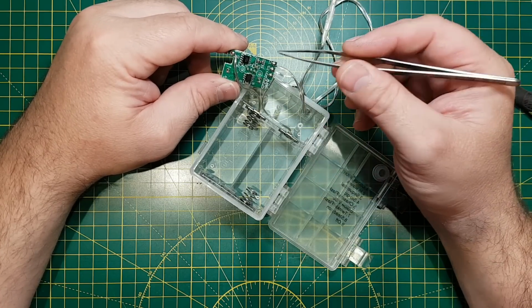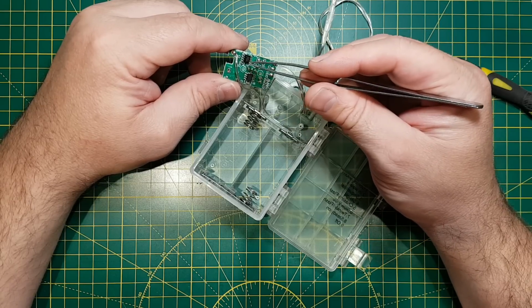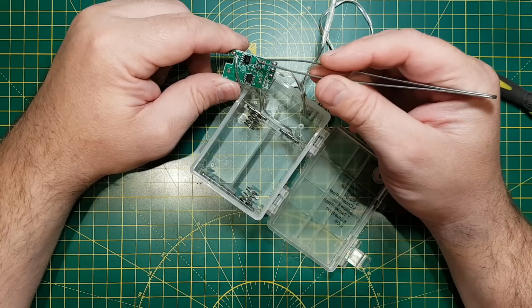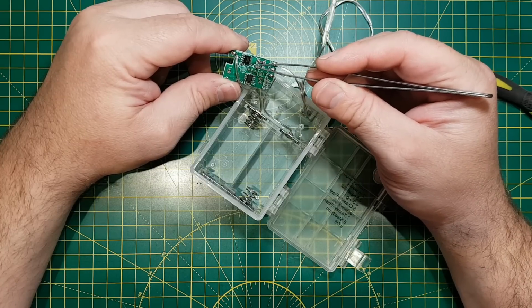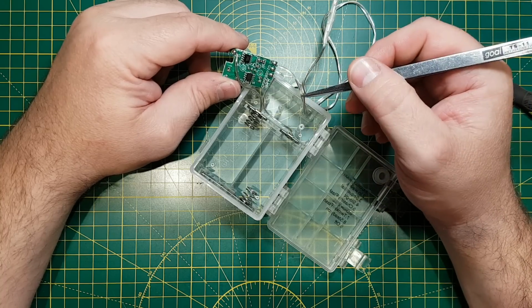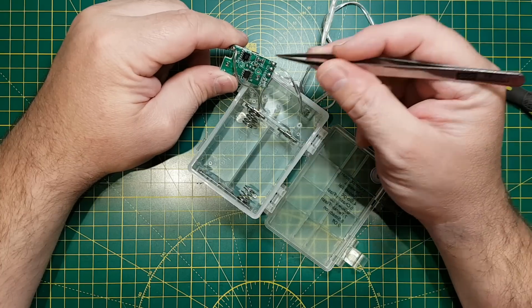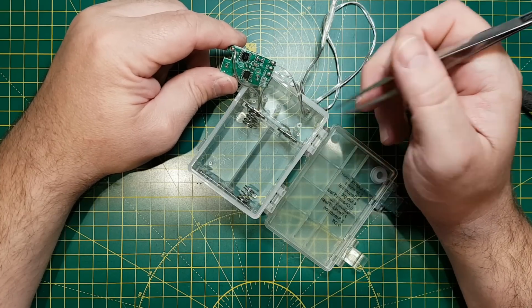So this chip here will be a Darlington transistor array. So inside here you've got one chip, you'll have effectively four resistors, four transistors, and it just saves you using all the discrete components. And it's quite a nice way to package it as well. It simplifies the circuit board.